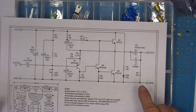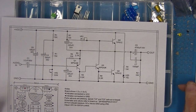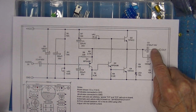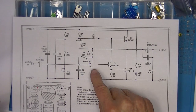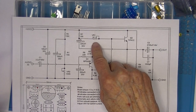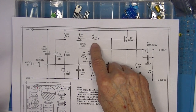This is the second time I've seen this, but not on the original JLH drawings. I think he skimped on the voltage here — I'd rather see a 25 volt capacitor here. Everything else appears to be kosher. He does provide a variable resistor here to adjust the current.